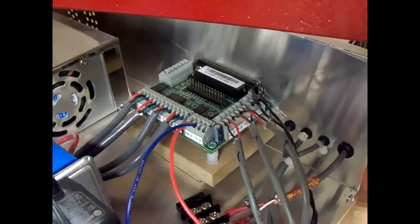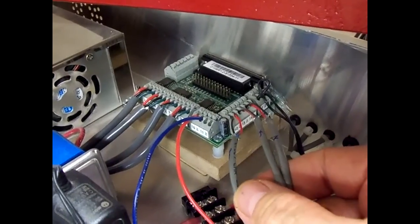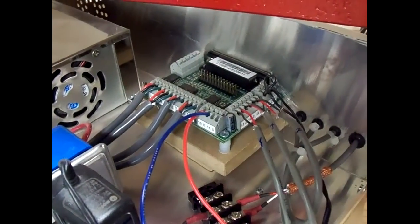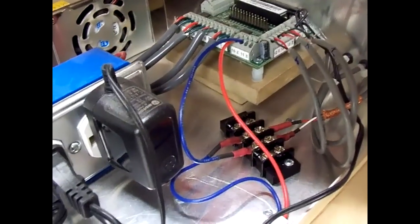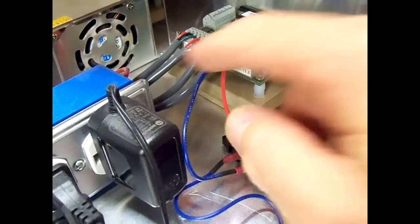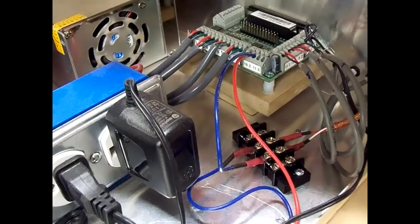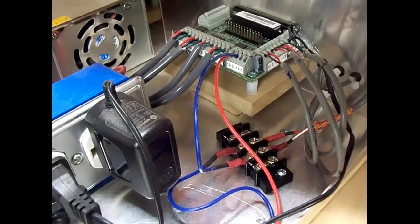This is where the three cables come into the panel box from the limit switches to the breakout board. They are hooked to pins 12, 13, and 15 on the C10 board. The e-stop switches are wired in series and connect together on a little terminal strip. They go to the breakout board where the original one was on pin 10 and the 5-volt. So the panel box is all complete now — we can put the cover on and put screws in to make it a little more dust tight.